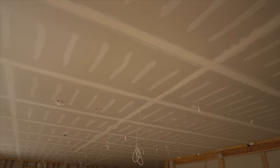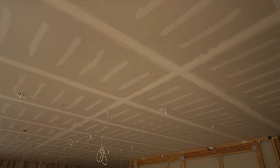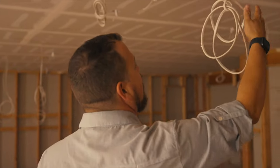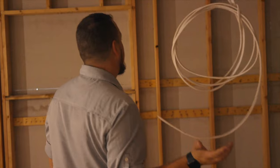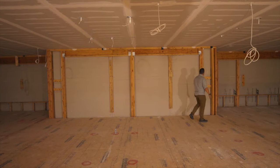It does mean an extra trip for the electricians — we have to lay out our walls, lay out our lights, get our mounting points in, and get switch legs coming out of the ceiling before we rock, and we've got to air seal them to something up above. We have an extra trip for the drywall guys because they're coming to hang this and then they have to come back later to do the walls. And we also have an extra trip for the framers.